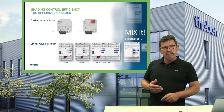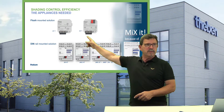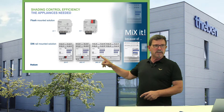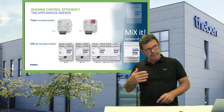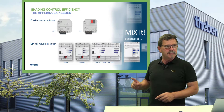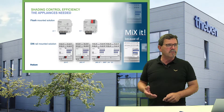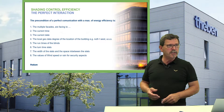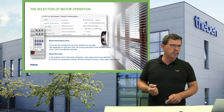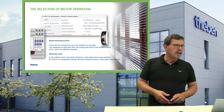You need a powerful actuator — for example a flush-mounted actuator, or the RF remote secure actuator, or DIN rail mounted blind actuators — single channel, mixable, or for bigger projects. If required, 24V DC actuators are available for blinds operating on 24V. In general you need a powerful actuator, and you need a weather station that is powerful enough to calculate on its own when and at what time and state the slats have to be positioned.